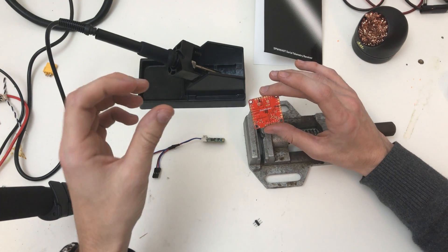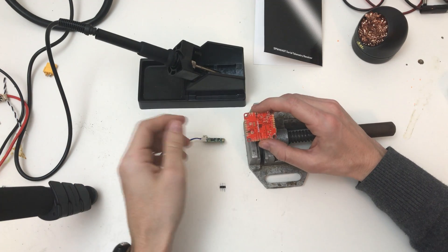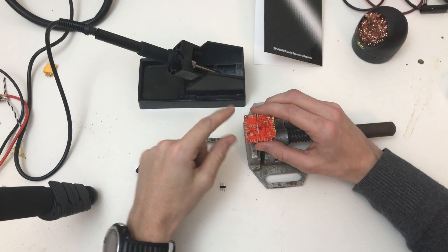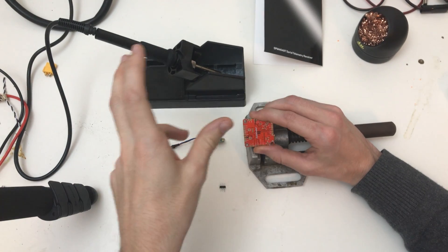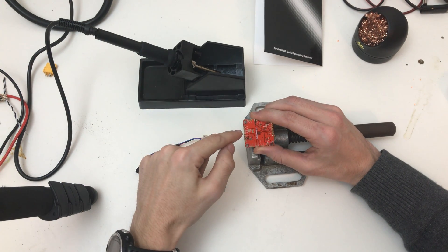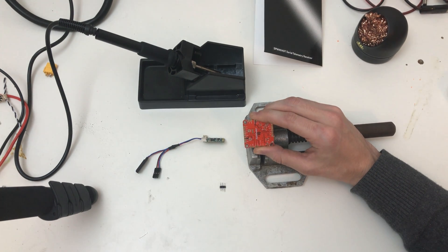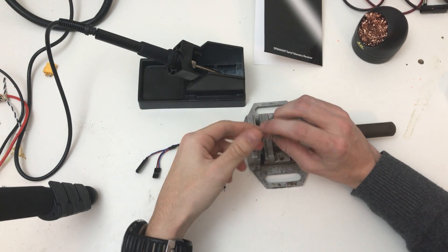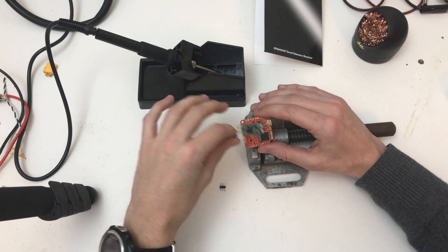I will show you how to sort this out, and we are only going to use three pins. The F4 chip has on one UART — in this case the TX pad — it can listen and send at the same time. So all we need to set up is the TX3 pad, the VCC, and the ground. If you look at the design, it's actually supposed to work together; they were designed at the same time with knowledge of each other.